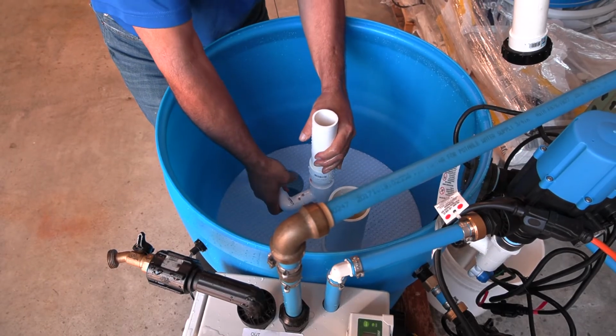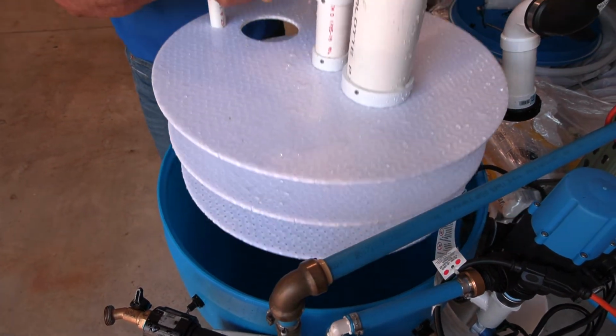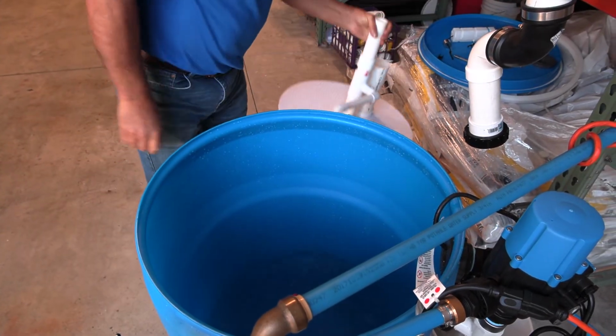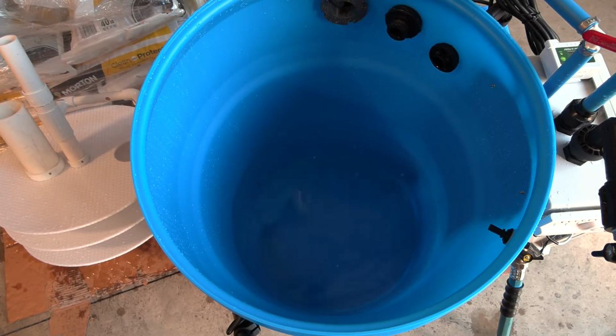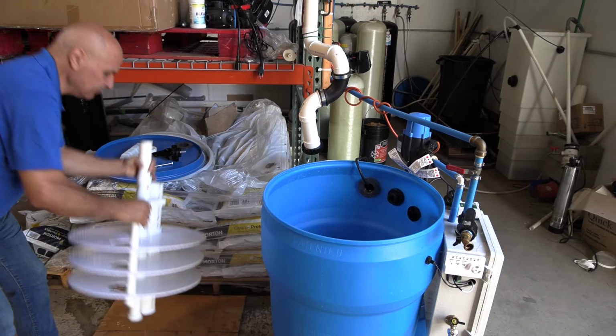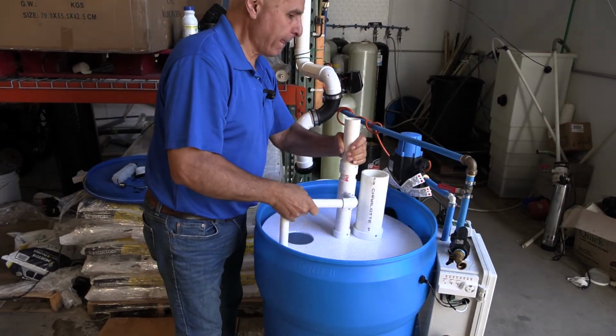At this time, just take the whole assembly, the aeration plate, out. You could drain the unit till it's empty with the shop vac or sump pump and wipe everything clean. After that, just put everything together the way they were removed.